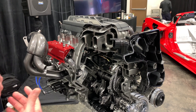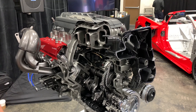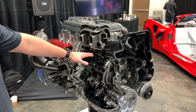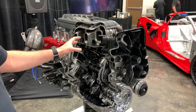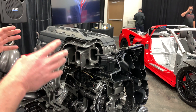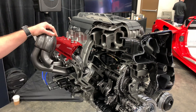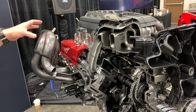The cam is a huge part of the power story, but starting with the basics — moving the engine to the back opened up a lot of real estate. Although we lowered the engine, not having to look over it means we can make it taller. We were able to increase the height of the manifold, and on the LT2 we now have all equal-length runners — a runner-in-box design that balances out all cylinders, improves flow through the manifold, and gains several percent power improvement from the manifold alone. That also works in tandem with the exhaust. These headers are worth an additional percent improvement in overall flow — they don't just look cool, they work extremely well.